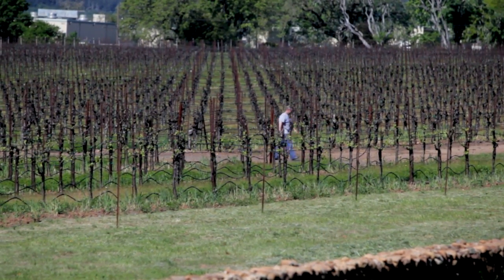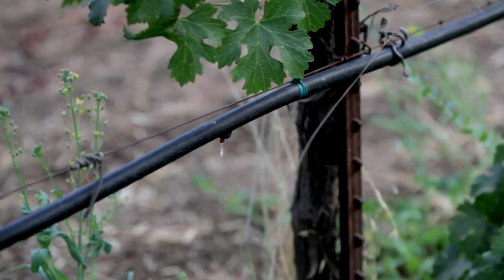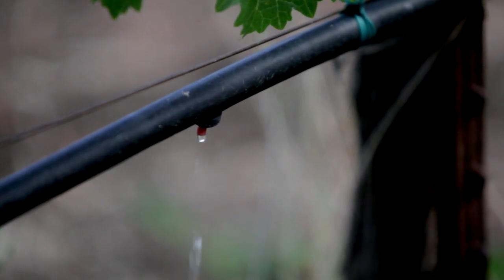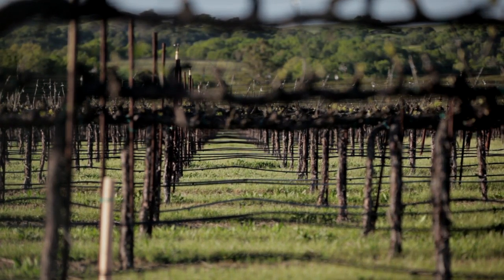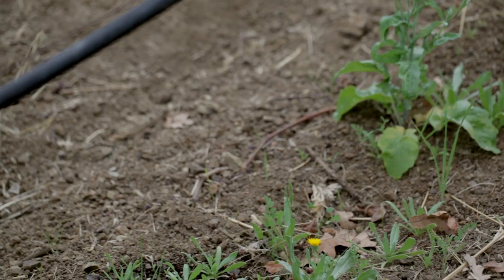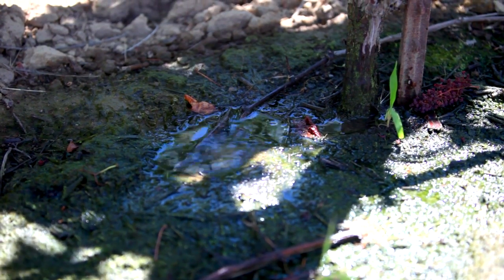Some of the major problems that occur when the pump isn't supplying proper flows and pressures is that you start to have problems with the distribution uniformity of the irrigation — that's how evenly you're delivering water to the target crop. If you're not having an even application of water, you have dry spots and wet spots in the field. You end up irrigating longer than necessary to get the dry spots wet, while the wet spots become over-irrigated. That's poor uniformity and bad irrigation efficiency, which wastes both energy and water.